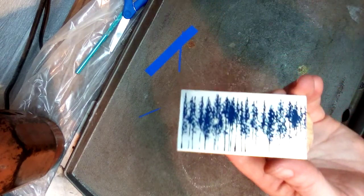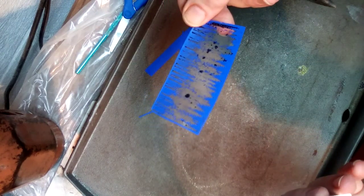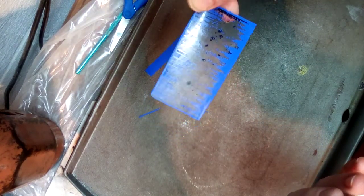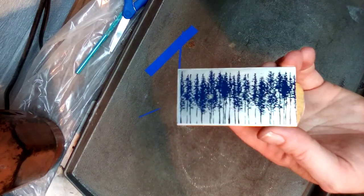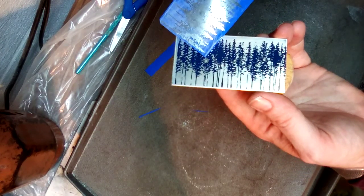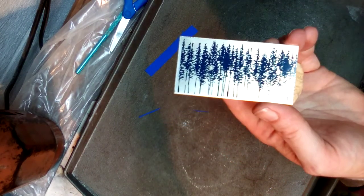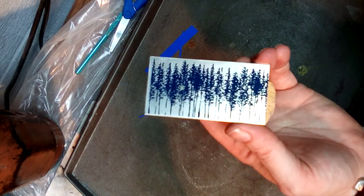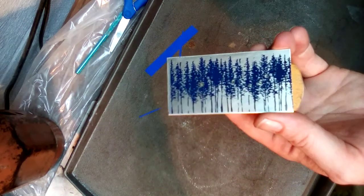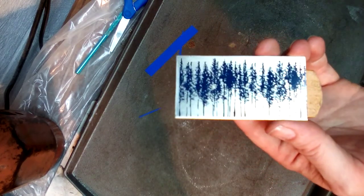That was really great adhesion. You can see by the black spots left on the transfer that it wasn't perfect — those are the bubbles I was talking about that I didn't get all the way out. There's one great big spot right there. If I wanted to, I could go in and try to repair that with some fingernail polish, but I'm not going to worry about it — this is good enough for my etching. Now I'm going to move on to getting it mounted and ready to go into the ferric nitrate. Thanks for watching and I hope that was helpful.